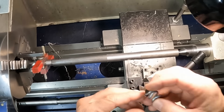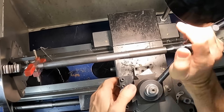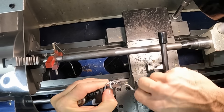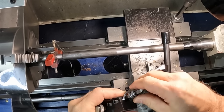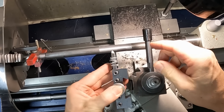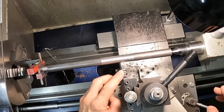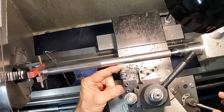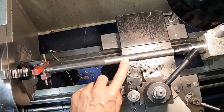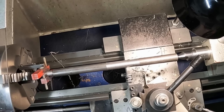I can do one more thing, but we're going to get to this a little bit later. This is anti-chatter wire. It's quite handy in certain situations. So let's see what this does. Let's stick that on the tool. Just to recap, I haven't changed anything else. I've put some anti-chatter wire on my tool. My tool distance is further than it was before, and everything is still like it was before. Now I'm actually going to go over part of this chatter and we're going to sort it out, which is actually probably one of the more difficult things to do.